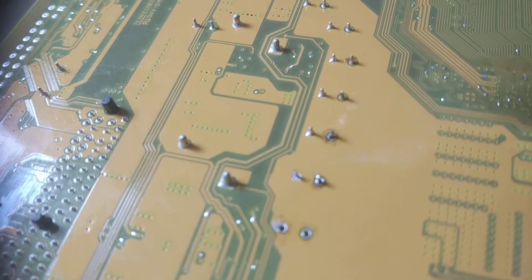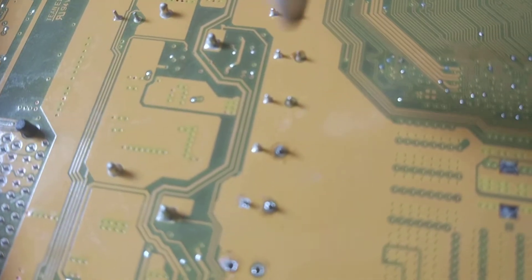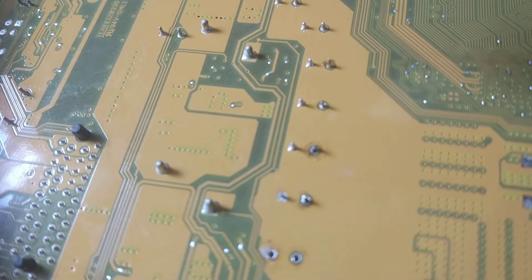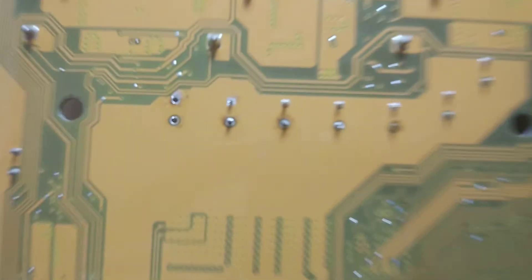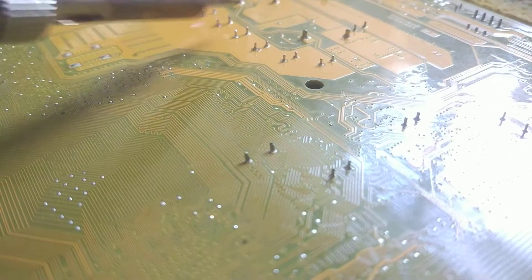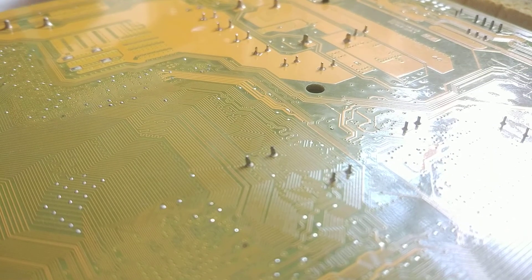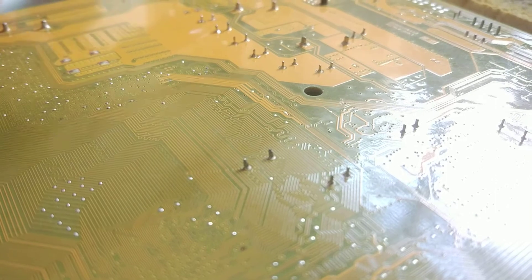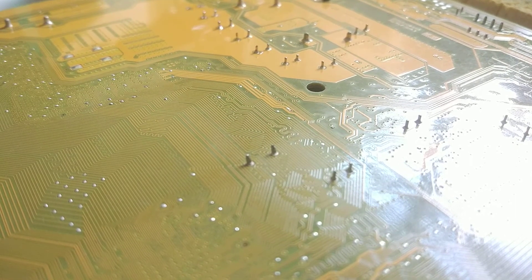Let's go to the next one. This one has already melted solder. It doesn't work all the time, but the first one was really easy to remove — was quite impressive. What I'm going to do is add a little bit more flux and try with the desoldering gun.